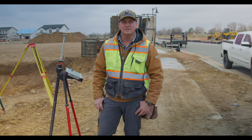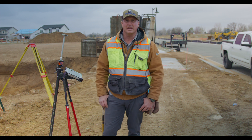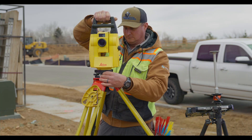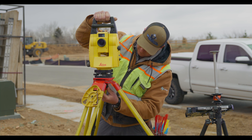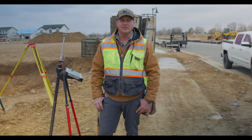In today's pro tip video, we're going to go through digital layout of the footing elements of the foundation. With the total station from Leica, we're able to do this with one person. In today's workforce and the limits that we have there, this frees up our crew's ability to have other guys doing other work at the same time. It's really easy to do with one person. You can usually get a normal job like this laid out in around 45 minutes and be moving right on to the next job for the day after that.